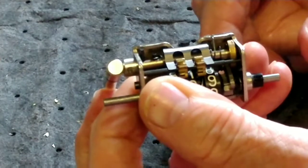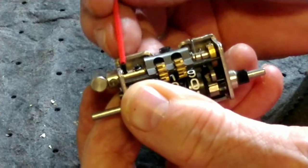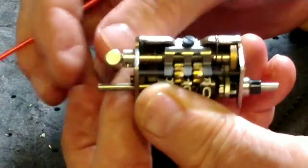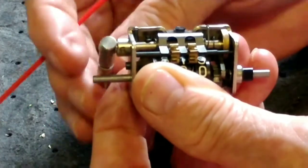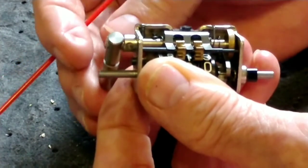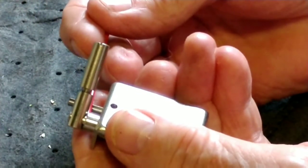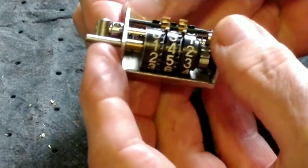Right. All right. I'm moving the trip lever, and I want you to look right here. This is a roll pin that's driven into the lever shaft, and that's what stops it in the down position. That little roll pin hits against the casing. That could actually have the tip broken off of it. And then it would completely malfunction, wouldn't it? Well, your lever would lay over in a position like this against the knob, and you would wonder why the row tripper isn't working correctly.